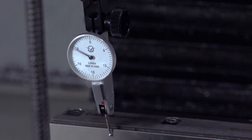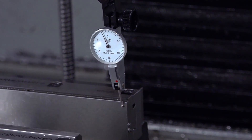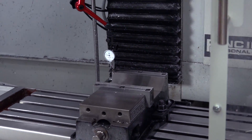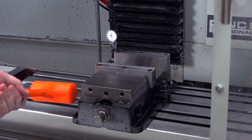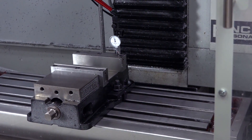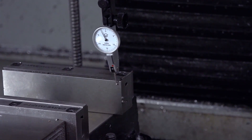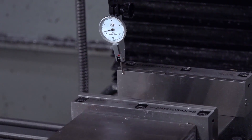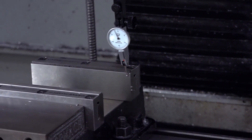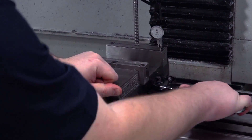It's about the same region — close but no cigar. I'm at about two or three now, and then I'm at about seven, so that's five difference. I think I'm just going to take it right to zero — just tap it in. You can see it actually starts moving farther away, so it went a little bit too far, so back it off a little bit. It may seem like you're going back and forth, but that's part of the game — we're all human, kind of get used to it. The idea is to get it so that needle doesn't move at all. I'm going to tighten this down a little bit more so my hits don't have as much impact, tightening this one to about the same tightness, and this one more so it's still my pivot point.